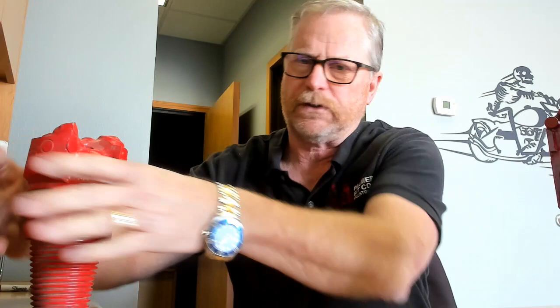Good day, Kevin Christensen with Palmer Bit Company bringing you another educational video on drill bits. Today let's discuss PDC drill bits. There are basically two different styles of bits: the full body and the wing style. This is what we're going to call full body — short gauge. The body itself is very large and very circular. Here is the wing style.